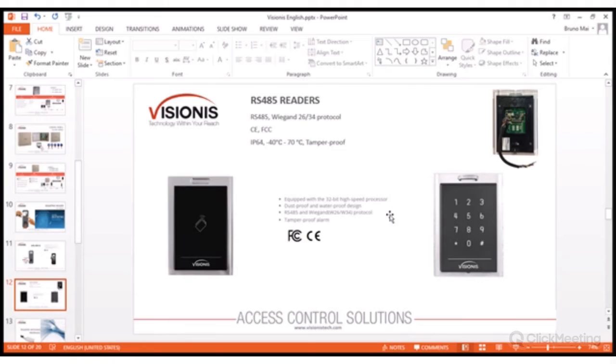Door 2 is the second one up and all of them down, and so on and so forth. This is a much more secure connection, as with Wiegand, I open the cables, I touch the green and the whites together, my door opens. In RS-485, if I were to find those cables, I can't touch them together and the door will not open. It's a secure connection. Third, it allows me for a longer distance.